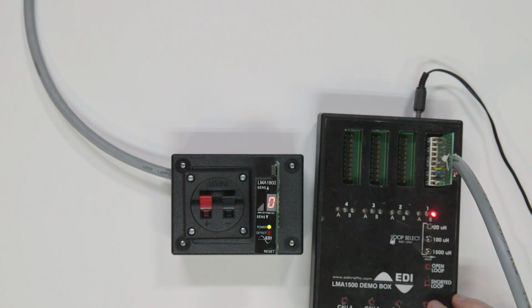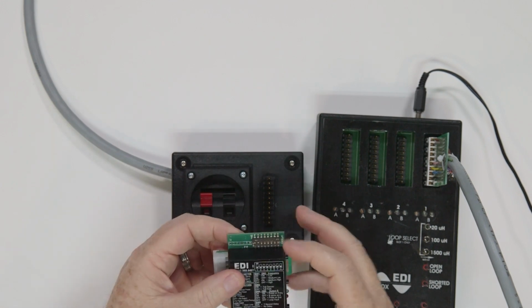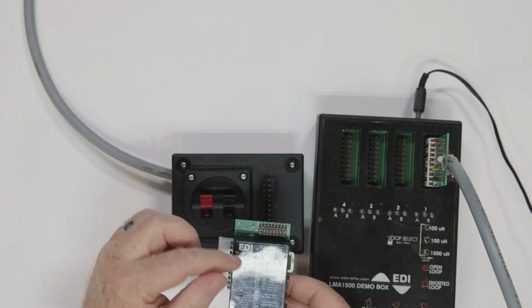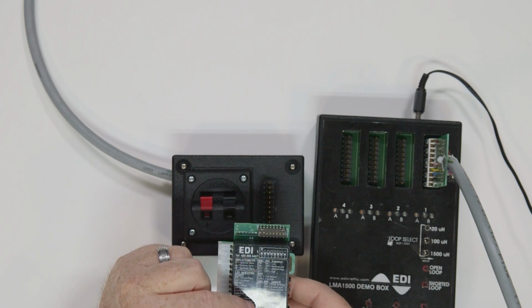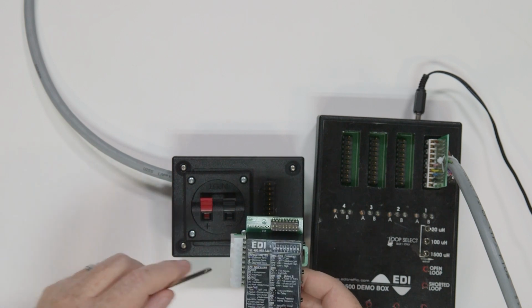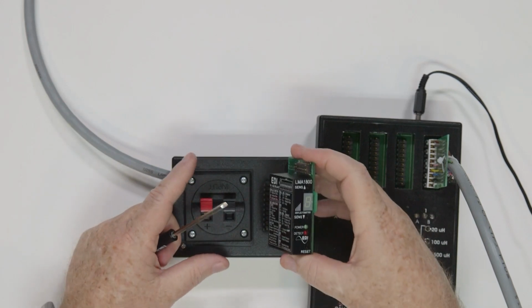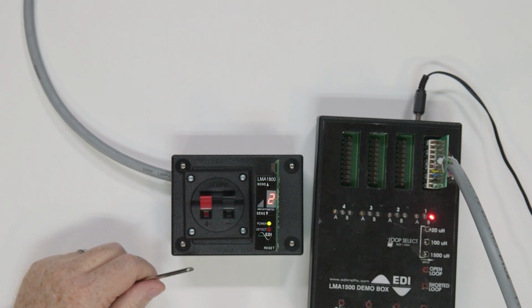To change this setting for the output relay A, you can do so by changing dip switch 7 on the 8 position dip switch on top of the unit. When dip switch 7 is in the on position, called normal presence mode, this feature is used at locations that have a compromised loop that periodically locks up. The presence detect output relay A hold time is between 5 minutes minimum and 3 hours maximum, and after that time, the detector will retune.